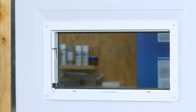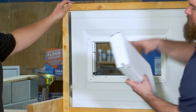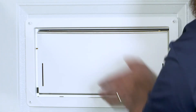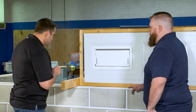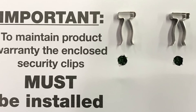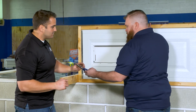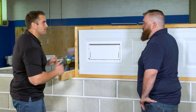Next step is Joe's going to install the door inside the vent frame. You're going to want to make sure that your float pins are facing out. There's a little track, and that track is where you slide that vent door in place — and now it's installed. We also want to install two security clips. These security clips prevent that door from floating out during a flood situation, since floods are violent. Pop one in on the right side and one on the left-hand side, and that door is then complete.